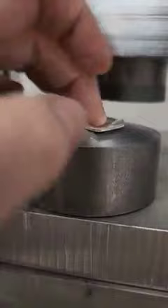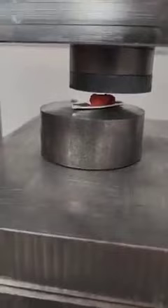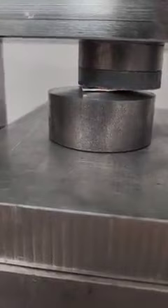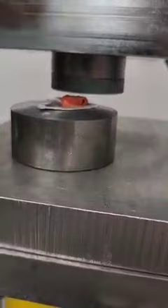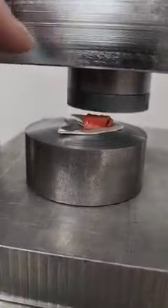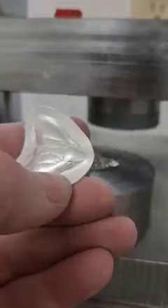We're going to do it one more time, a little bit harder at this point, because I'm not pressing the metal into the bottom of the die yet — the pressure gauge isn't even registering any pressure. I'm going as slow as I can to start to get that metal down into the impression die without causing the metal to stretch too much at the edge, where you're likely to get cracks.